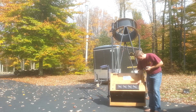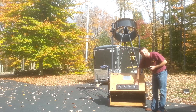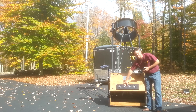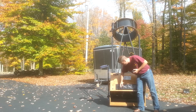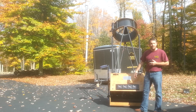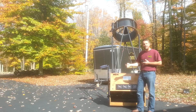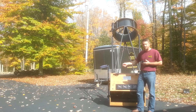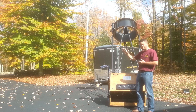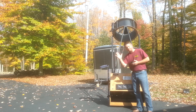On the 27 inch here, we have our fan box with a detailed routed edge for a nice appearance. It's painted satin black to match the crescent bearings, and you have four boundary layer fans. We have a potentiometer so you can turn these fans up and down. If you like to do high power planetary observing, this is a huge benefit — if you have them on full blast straight into 12 volts, it's going to disrupt your view at 250x plus. By having this potentiometer and being able to turn the fans down, you don't have to worry about that vibration.